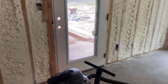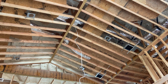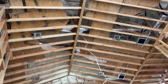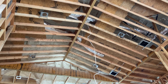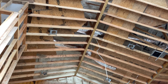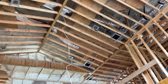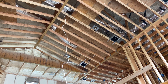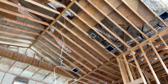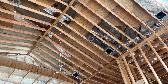The other electrical challenge before drywall is the vaulted ceiling. I've got six can lights - three on each side - and a 14-3 wire coming down the middle for a fan or light/fan combo. You can see the haphazard decking I built up there to do it all from the top. Thanks to my father for fall protection gear and a harness - I was tied off. Being up that high was nerve-wracking, but I got it done safely.